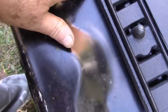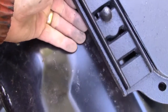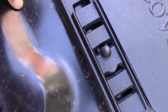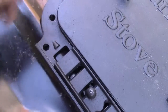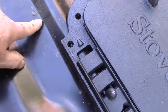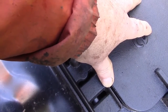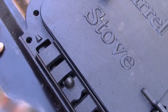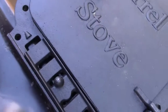However, down here is going to be the problem, because I've got to cut this open so that we have some room here for this to work. Is it going to be easier? Well, it doesn't hurt to try. And if worse comes to worse, I just have to buy a little bit bigger piece of plate to cover the cuts that I put there. The other option is if I just cut those off completely and let the sides drop in, then I may just have to put some flat stock across the bottom of the top. Once I get a hole cut, I might be able to bang this metal around a little bit and flatten out some of the small stuff.